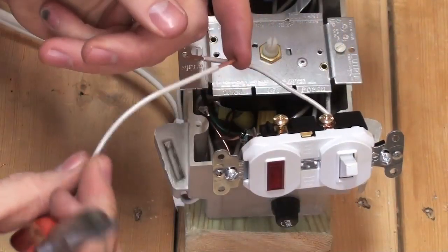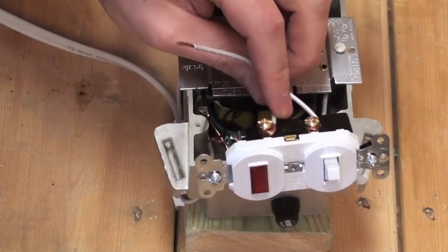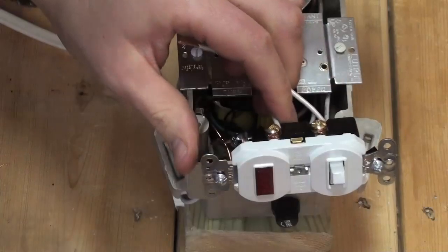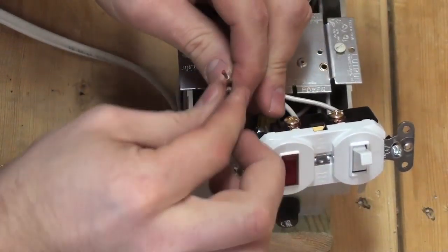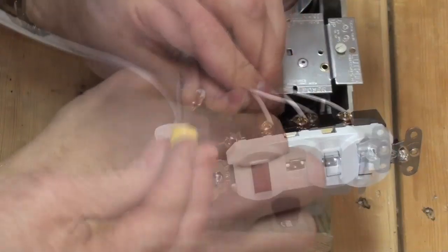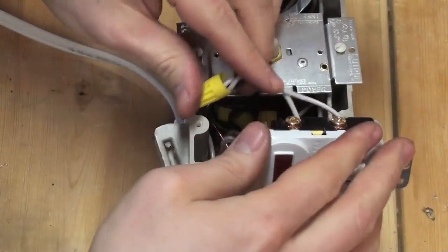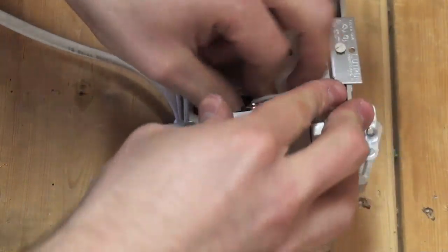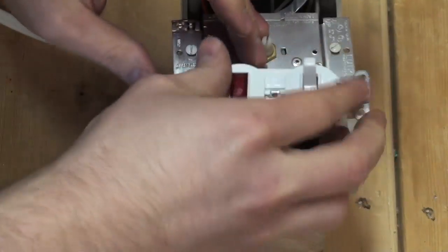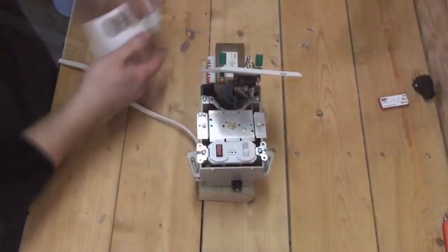Take another length of connection wire and attach to the positive terminal on the pilot light. Take these 2 jumper leads and remaining positive lead from the dimmer switch and splice together. This bundle of wires should then be buried into the electrical box. Some manipulation of all remaining toggle switch wires will be necessary to fit this component into the electrical enclosure.